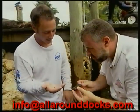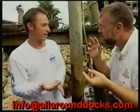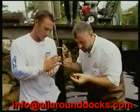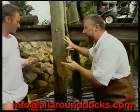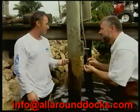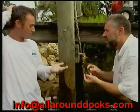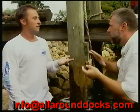So it's going to be able to get all the way into the center of the piling. This is a gribble worm, and these are found in more southern tropical areas — down here in Florida and the eastern seaboard when the water gets warm. They go dormant in the winter. We're talking salt and brackish water — they just eat away at these things. This is very good quality marine grade lumber here. How are these things eating it? The pressure treating they do on these pilings is just for application into the water. There's nothing inside the piling that's going to stop this guy from getting in there. He's going to eat no matter what — 24 hours a day, he's eating. And this happens all over the world, anywhere in salt or brackish water.